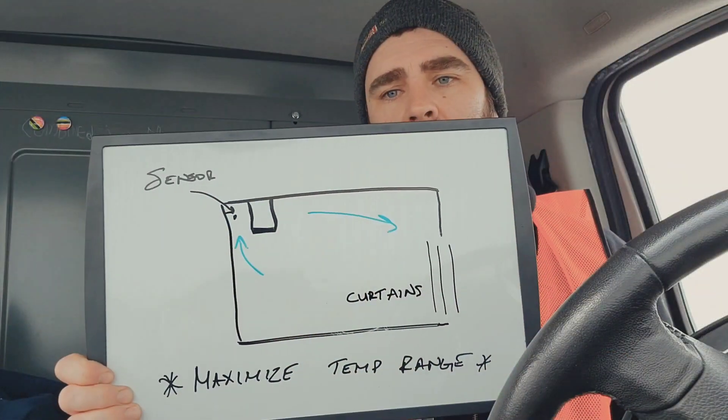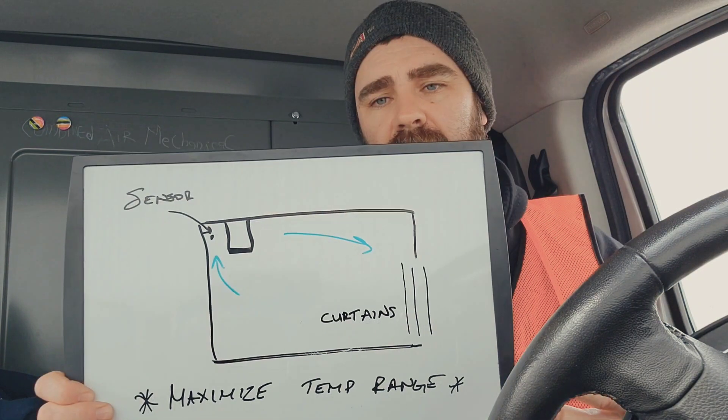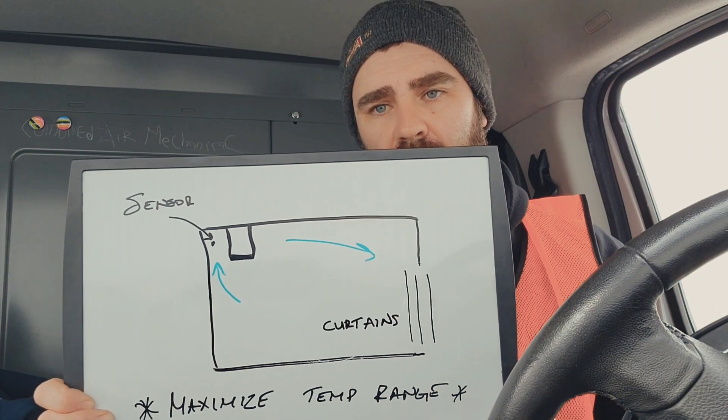I have come across coils that have frozen where there was nothing wrong with the actual machine. It was just that activity in and out of the box was frequent, it was a high-humidity situation outdoors, and every time that door opened and closed, moisture would move in. The temperature would rise, creating longer runtime, more humidity, more moisture sticks, more it freezes, more it builds — more chance it's going to ice over. There are ways to mitigate that, and on the whiteboard here are things we can go over.